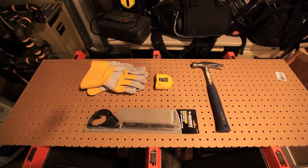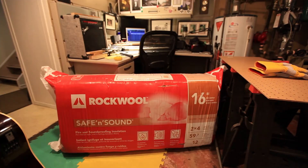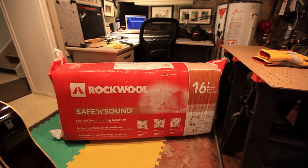There's a package of rock wool — I'm using the Roxul Safe and Sound made for two-by-fours. Make sure you get the right one depending on your framing. I have wood framing, so this is for two-by-four wood studs. There is also a special product for steel studs, so make sure you get the right one for your application. These are the 16-inch centers for wood framing, floor joists, or ceiling, and this comes with 12 panels. The actual dimensions of each panel are 15 and a quarter by 47 inches.